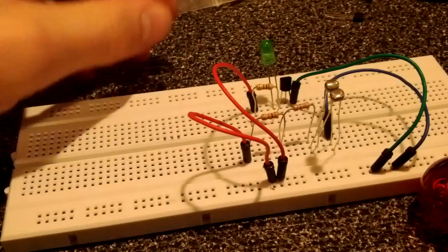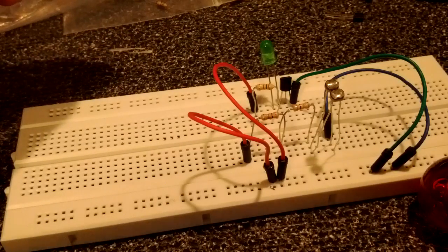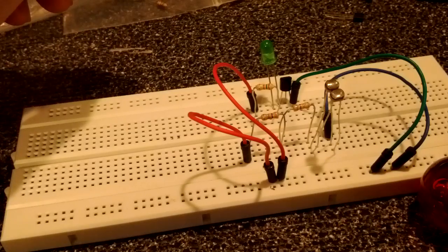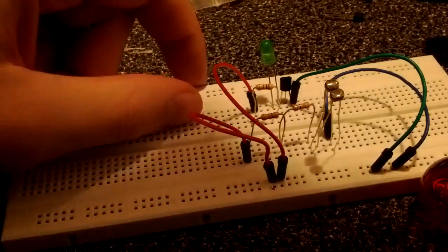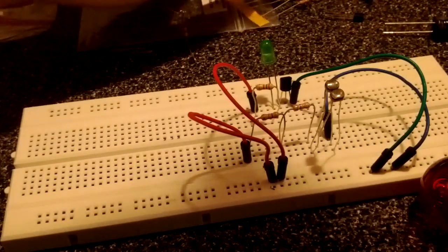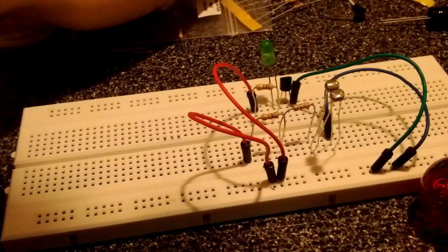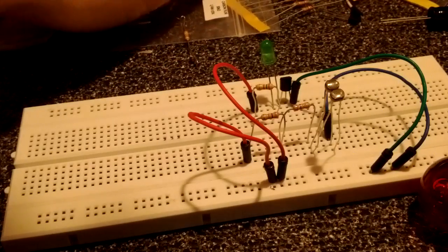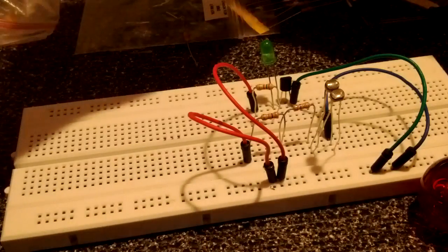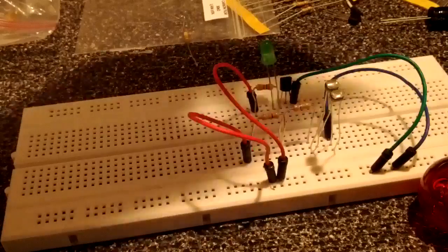0.2 milliamps, we know that we're sitting at 2.5 volts. V equals IR, so R equals V over I. So we've got 2.5 volts divided by 0.0002. That took a second, which is a lot. That's 10,000 ohms. So we'll see what we've got in our pile of resistors here. We've got a 4.7, 33, 270, 10 million, 2.2. Let's go with a 4.7 for now. We'll see how it behaves. If our math is wrong, we'll find out pretty quickly what's going on.